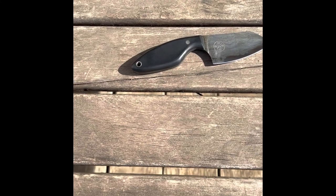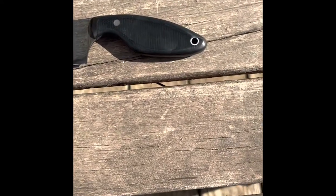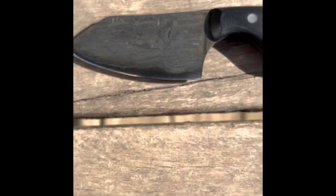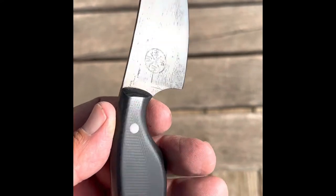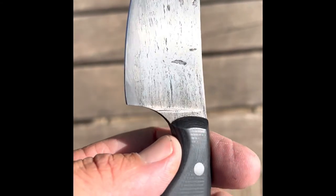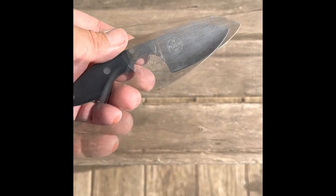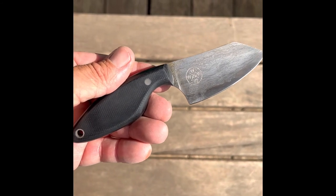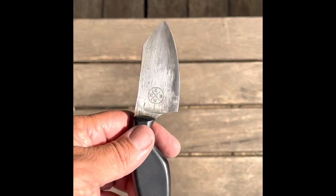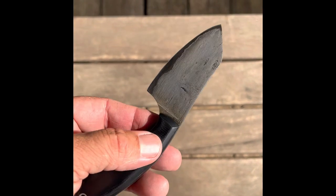After some hand sanding and buffing, I got this little dude done. I'm pretty pleased with it — I really like the look of that wrought iron. There were a couple of things I didn't care for: you can see on this side of the blade I went one too many trips on the roller mill, got a little too thin, and I wasn't able to grind out all the divots. But other than that it turned out well. It's not going to affect the functionality of the knife — it's just going to give it a little character. The core was centered, it looks good. I'll do wrought iron again. Next time I'll leave it thicker so I can grind it down more and show a little more of the core. I think it's going to make a good knife. I'll end up making a sheath for it. I appreciate you watching — you can find me on Facebook at 4WKnives. Thanks for watching; like and subscribe — I'd like to build this channel up a little bit.